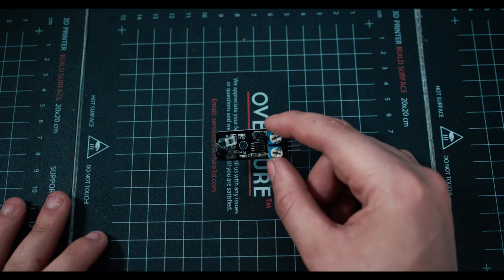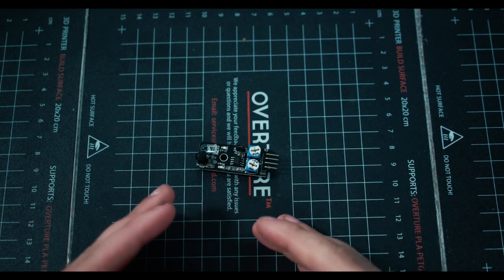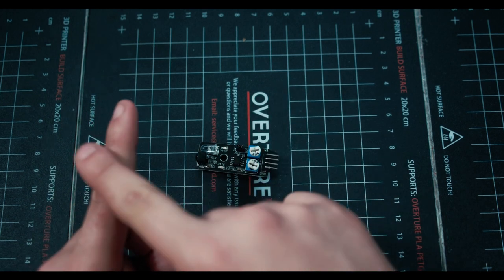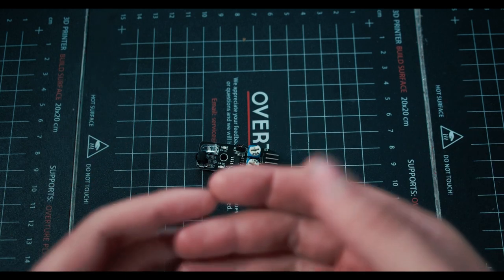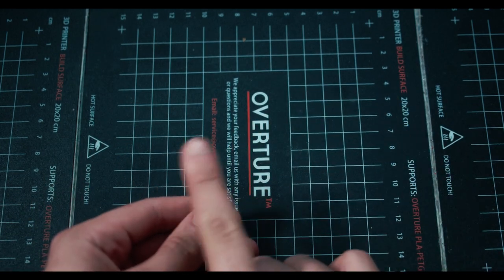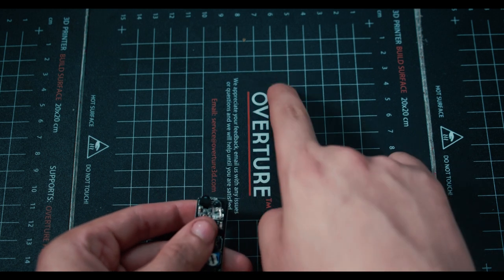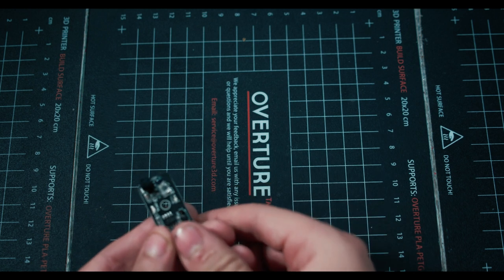Well, here's another addition to those types of videos. This is an object avoidance sensor. It uses very similar tech to the sensor where we had two poles that were sending an IR sensor between them, and when something blocked it, it freaked out and said, hey, something's in front of me. Very similar to that, except instead of putting it between two poles, it's shooting it out and expecting it to receive back. So if I just start shooting it out like this, nothing would happen.